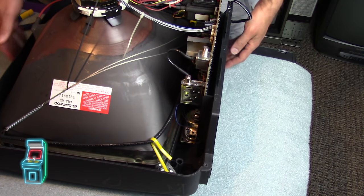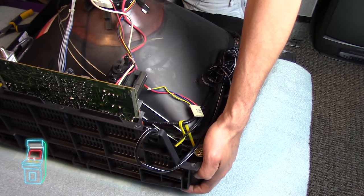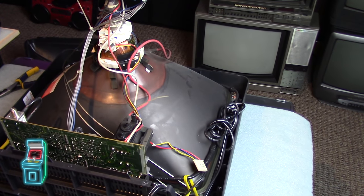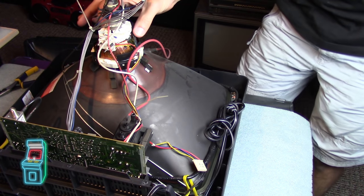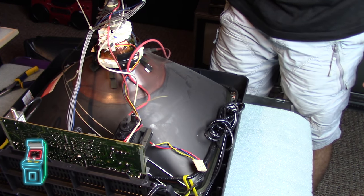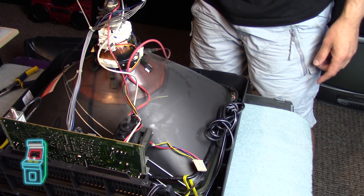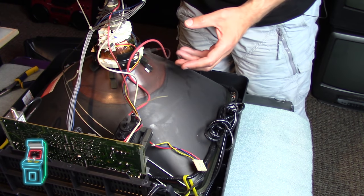Typing in 48JLL40X narrows it down to one result: 6.3 volts for the heater, G1 is 50 volts, and the neck is CR31. That's usually how I tell what's what. It's really cool that you can type everything out on that website. So this is a CR31 — it's a newer TV, which I kind of assumed. This is probably going to be good for a K7000. With a K7000 you can just swap the yokes — the yoke is this part right here. You loosen it and the whole thing comes off with the purity rings.